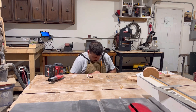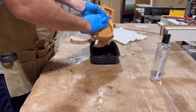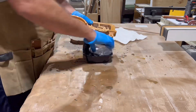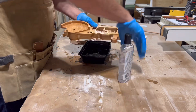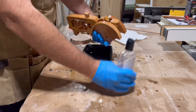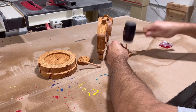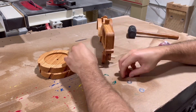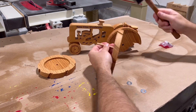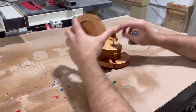But the good news is, once we're done with that, it's time to apply finish and then we're almost done. When it comes to finish for this project, I ended up using cutting board mineral oil. I didn't have a large enough container to soak this in, so I had to get creative and pour it all over it. If you do have a large container, definitely soak it in there. I ended up doing this by hand with some gloves on, and I also soaked the wheels off camera. After that, I simply press-fit the tires and added some washers in between the axles. I didn't want to glue these in because the dowels were a tight enough fit where I didn't think it was necessary — plus, if I want to take it apart in the future, I can.